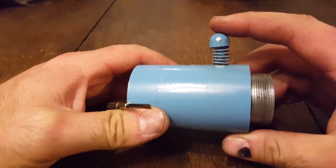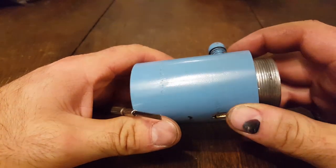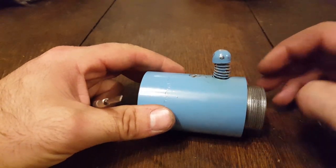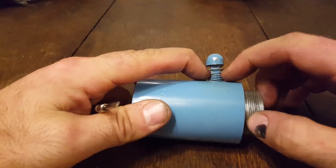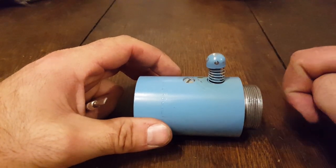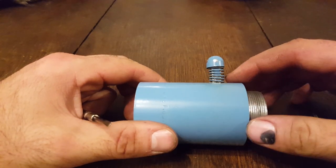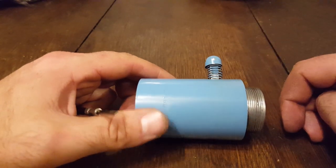This is the M404A1 fuse. You can tell the difference from the M405 fuse because the pin here is square and the hole is square. If it's round it's an M405, and the square ones make it an M404.